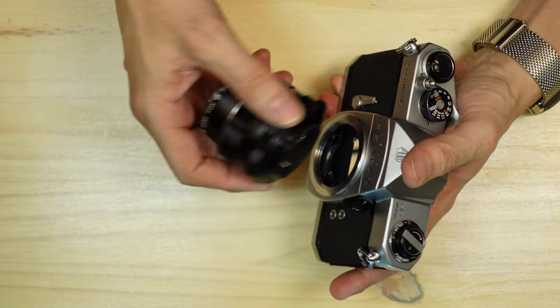This Pentax lens, like many other lenses of that era, had an auto and manual switch relating to aperture control. The original lenses had no way to keep the lens open at maximum aperture other than to turn it to maximum aperture. With these lenses there was an actuator pin — that small pin right here — that would close the lens down to the working aperture. The switch on the side overrode that. On automatic, the aperture pin controlled things. On manual, it would stop the lens down to whatever aperture was indicated on the aperture ring.